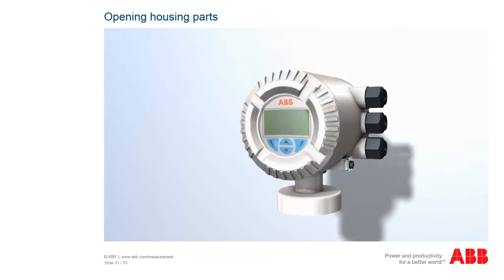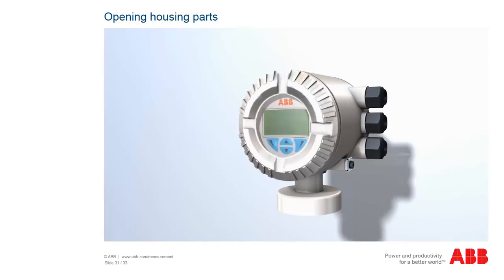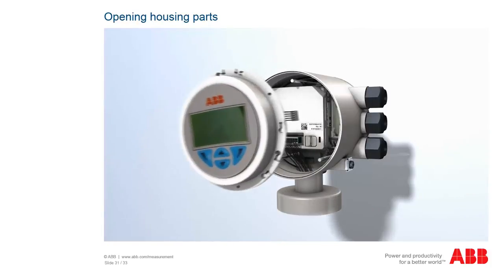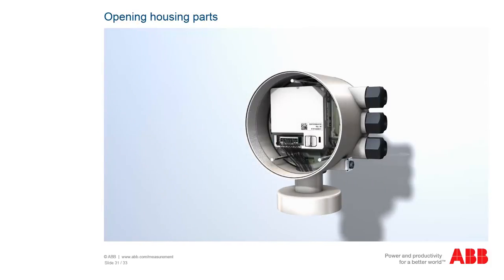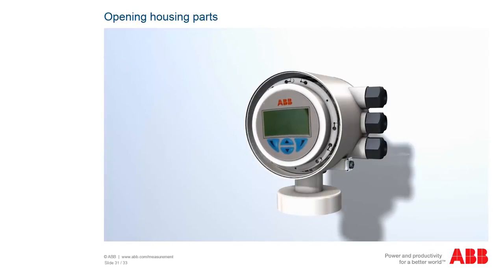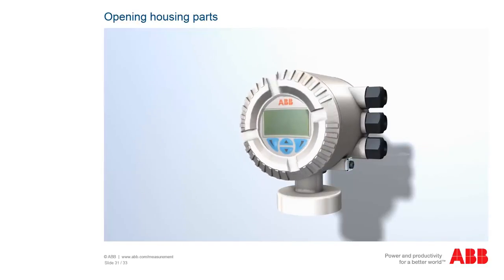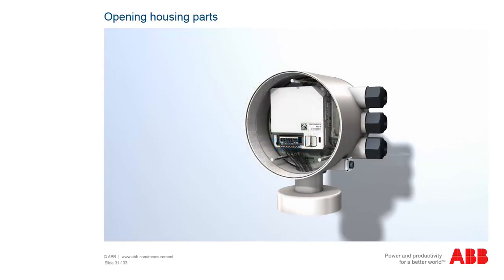Open only those areas of the housing which need to be opened for the respective activity. Housings of explosion-proof electric devices should be closed for as long as possible during assembly and installation. This means that they should be opened for no longer than necessary to conduct electrical connections and other required test and setting work. We know from experience that keeping the housing open for longer periods of time leads to increased collection of humidity and pollution inside the device. This impairs the condition of the creepage paths on insulation surfaces and can lead to the formation of creepage distances and therefore to short circuits over longer periods of time.